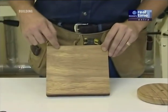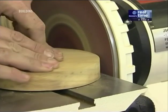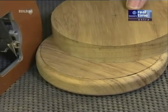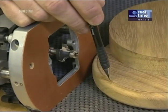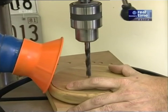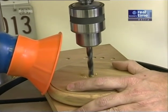There's one of the wheels for the serving trolley. The second one I'm going to make out of this blank — I've drawn a circle 150mm in diameter and I'm going to rough cut it out at the bandsaw, then sand it to a perfect circle over at the sanding station. To get this effect on the wheel I'm using a rounding over bit, but instead of making the point on the bit flush with the surface I've set it a little bit deeper, and that'll give us a step detail which is more interesting for the wheel. I'll also drill a 10mm diameter hole in the center of the wheel over at the drill press, and that'll be for the axle.